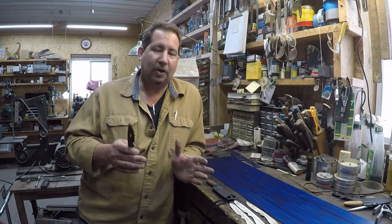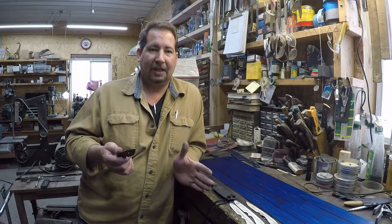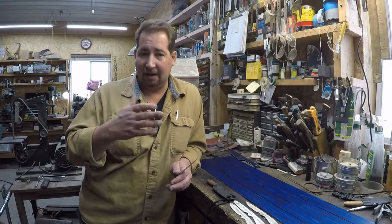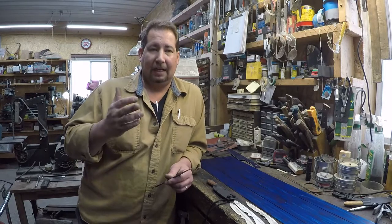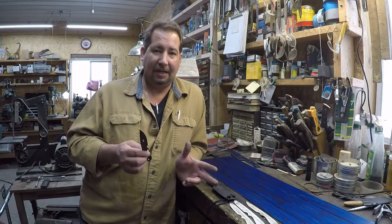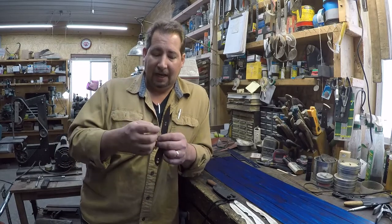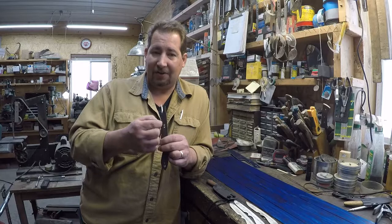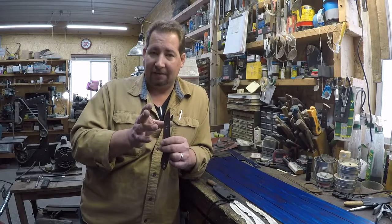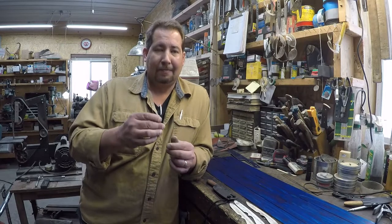You've got okay flexible strength with 1095, until you get into fairly thin blades. Once you get real thin, then you get an awful lot more flexibility. If you do extreme heat treating, if you're really after flexible strength and you only do a very shallow edge quench, and a very thin grind, then you can get a lot of flexible strength out of 1095.